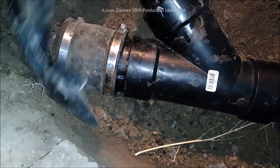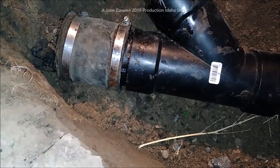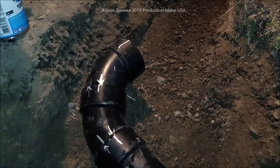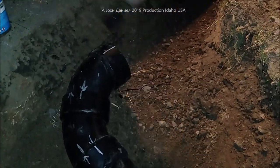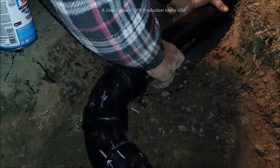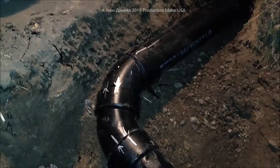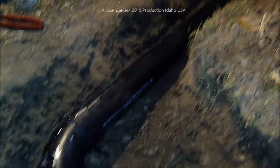We're almost there. We're going to drop this over here so it's ready for the pipe to be put in. Usually I'll leave this turned up. I've got my plumb mark there and we're just going to go ahead and do the glue — a good generous wipe of glue. Temperatures out here are about 38 degrees, so not the greatest for ABS glue, but just fine for our purpose. We've got a nice layer of fall. Make sure you get your level and we'll tunnel out a little bit to balance that out.